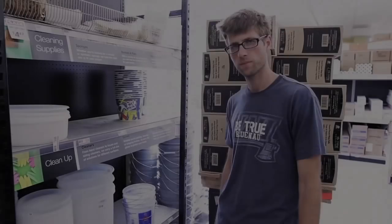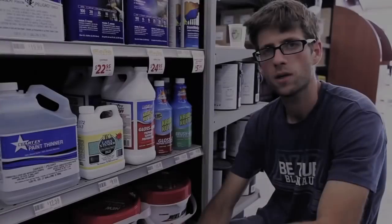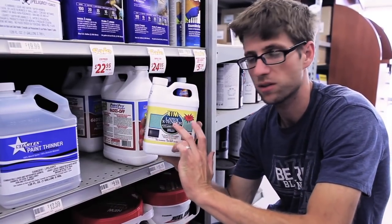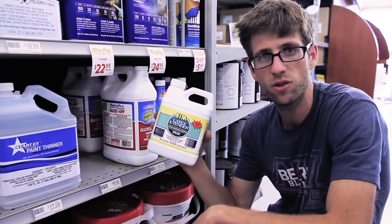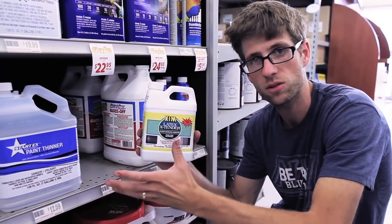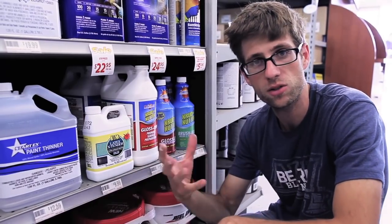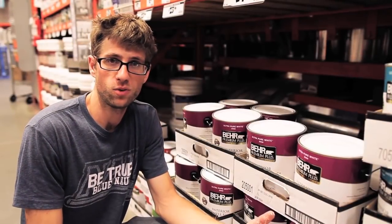I just get the white tape. You're going to need a bucket - really doesn't matter what kind. Something else I'll keep with me the whole time I'm painting is some latex extender. Here's some made by XIM, but the keyword is 'latex extender' because there are other brands that make the same product. What it does is slow down the dry time of the paint and give it more viscosity - we call it extending the 'open time' of the paint.